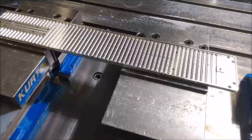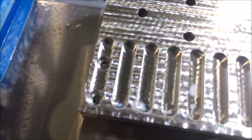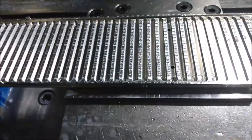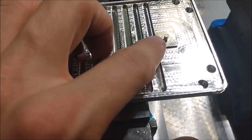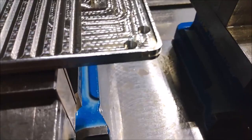Alright, so that second setup just finished. You can kind of see all the stuff in here — you've got all those grooves milled, the midship lights right here. This is the flat spot where that frame for the spread axle is going to bolt from the other side. You've got all the bolt counterbores in there so we can screw those pieces in. I got the chain pin milled in there. And this little surface right here — that plate is probably not going to get painted. Most of this under here will likely get painted black, and then this will be left bare metal so that if it rubs on that fifth wheel there's not going to be any paint coming off there.